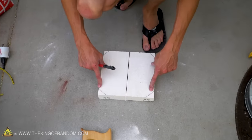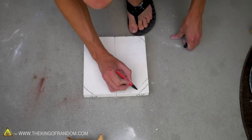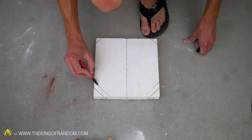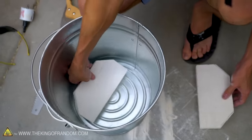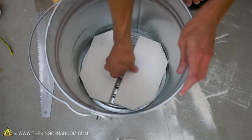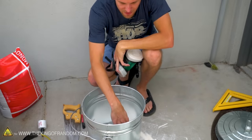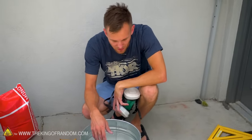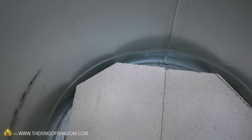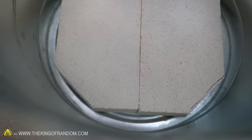I've marked off approximately where the edges of the bucket are — this is the outside — so I'm gonna take it in about that far. Let's check the fitting. Yeah, that fits. As you can see there is a little bit of a gap, and part of that is because of the dimensions of bricks versus the dimensions of the bucket. The bucket is tapered so it's really close to the walls at the bottom, but even just one inch up the gap grows a little bit. So we're gonna use some kaowool to fill those gaps.